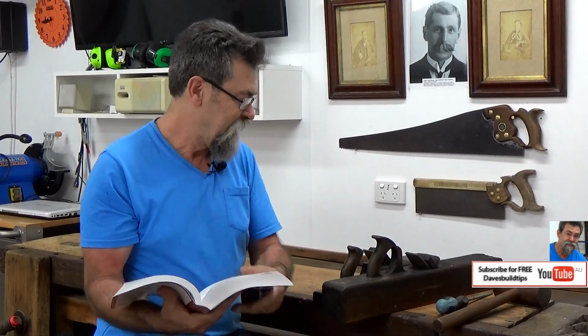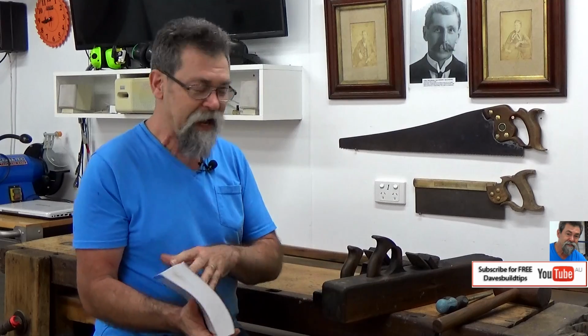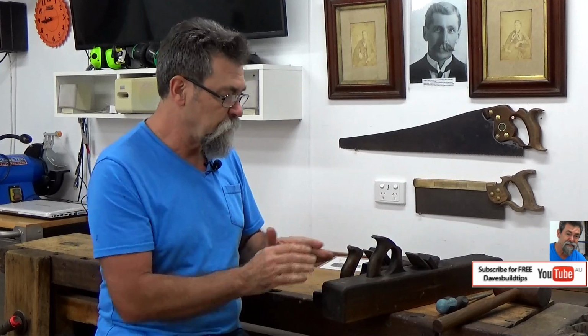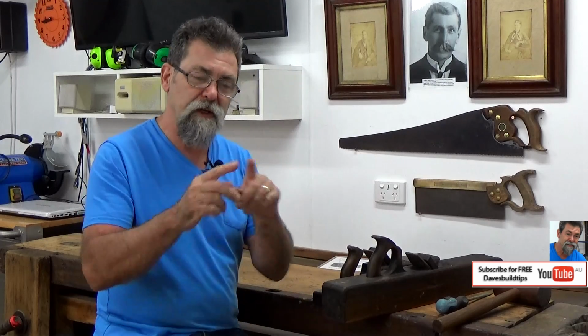I love it. So that's the trying plane, and then the jack plane, as I said, was for reducing things down quickly. Now also all of these planes had different width blades for their purpose. The trying plane was wider, the jack plane is narrower. The trying plane has a straight blade, the jack plane is straight with curls up on the edges. That's how they did it.